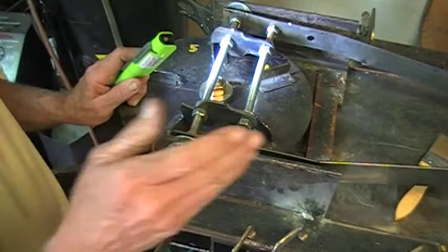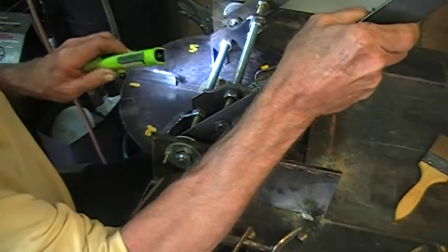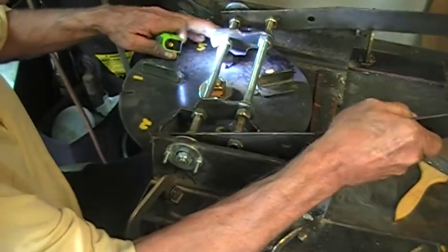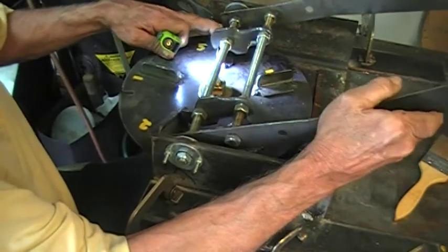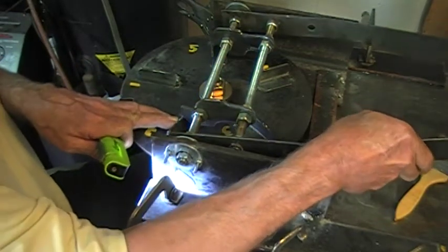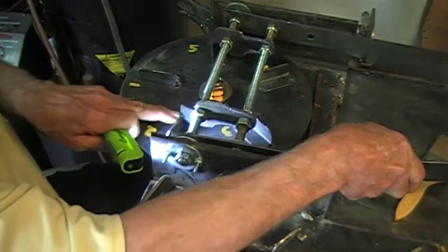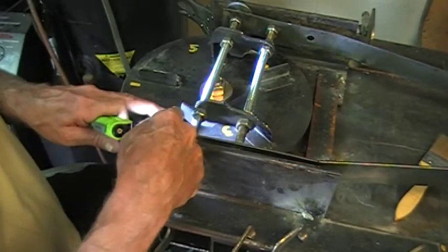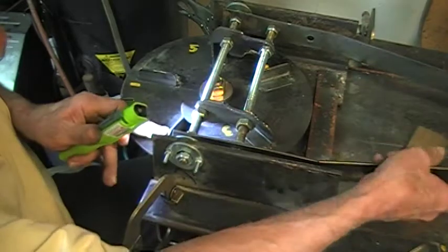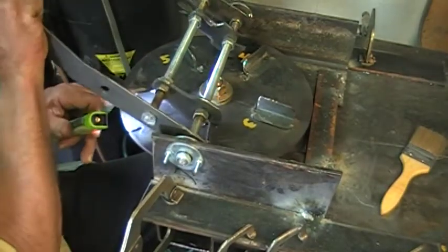Now just to show you what I'm talking about — we've got it upside down, so when I'm raising up on a pinion, then it's falling. At this point right here, you see I have no waste. It's not moving. If I put it down here, then it's moving. So at this point it's driving, pushes — did you hear that little bitty click? Now over here it touches. If the pinion continues growing up like so, then this rides that curve. It's a curve that is exactly the same radius as from the pivot point right here. Therefore, as the pressure is being applied in this direction, it does not move — it simply rides that curve until it comes around at this point and pushes until it clicks.